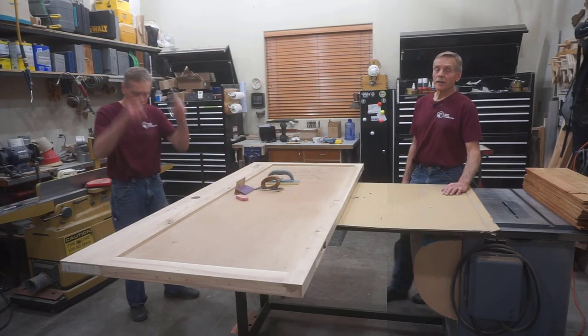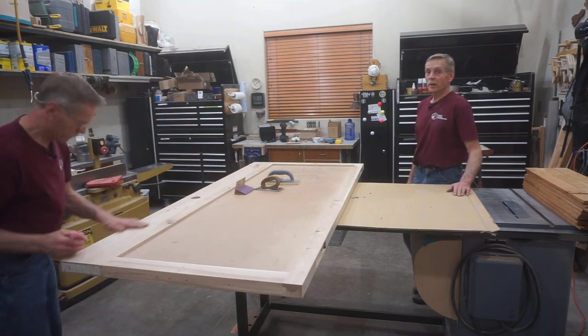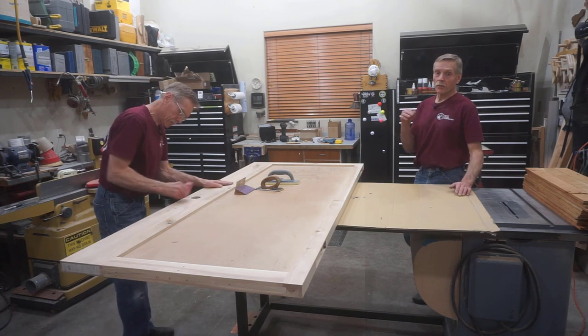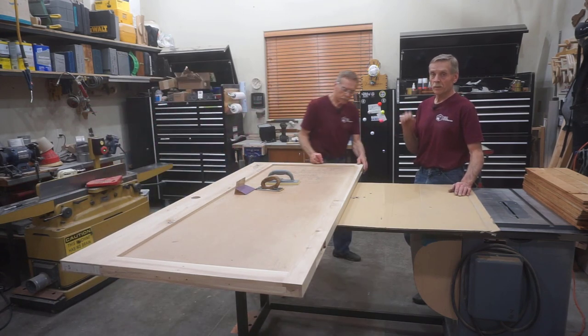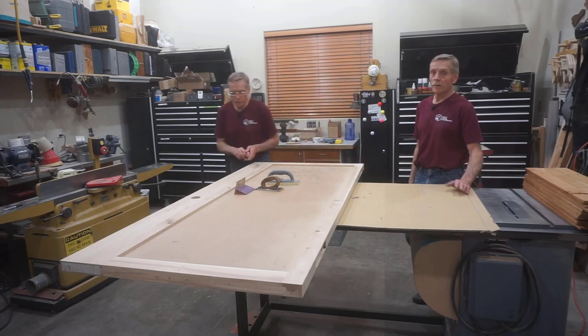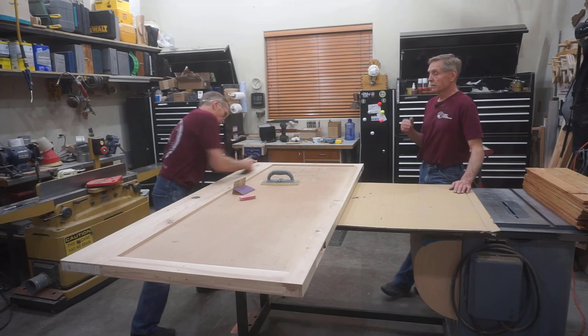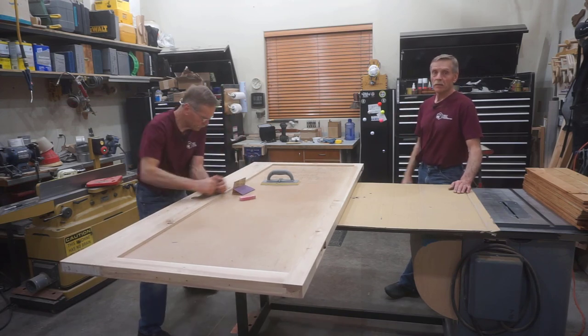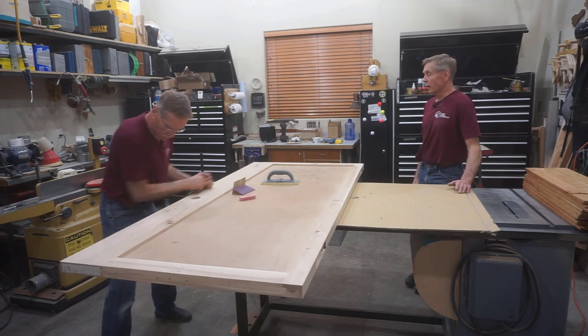Once all the mundane hardware steps are handled, the cleanup and sanding process really goes quick. I just make sure that I do each step thoroughly — erase all the pencil marks, sand everything with 150, sand everything with 220, sand everything with 320 — in a systematic approach so that I don't have to keep going back to catch little spots I missed the first time through. That systematic approach really pays off.